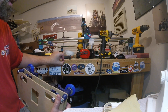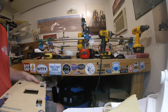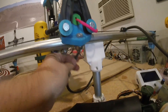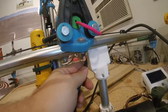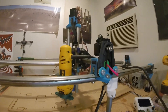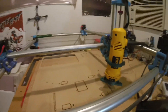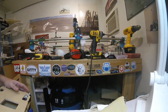I want to turn it into a better torsion box with a skin on the bottom as well as the top, and maybe go to some thinner material since I don't really need it that thick. You can see I've been doing machining and had some fun failures - my power cord for the router got caught between the roller and the brace twice, because apparently I don't learn from my mistakes.